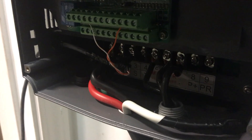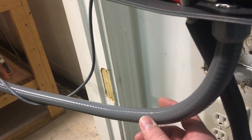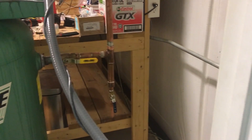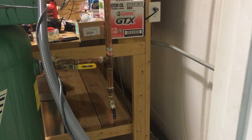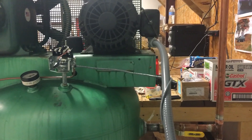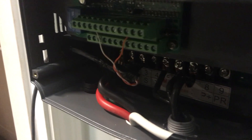If you're going to put a VFD on your compressor, you definitely do not want to just use a contactor. You can't treat the VFD as if it were three-phase power straight from the utility — you can't just cut power to it mid-run. The VFD will definitely not like that and might let the smoke out. Use the built-in controls, and that's how you actually get the benefits of the VFD.